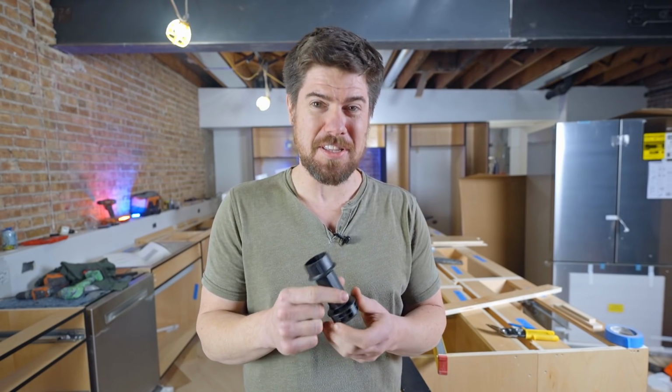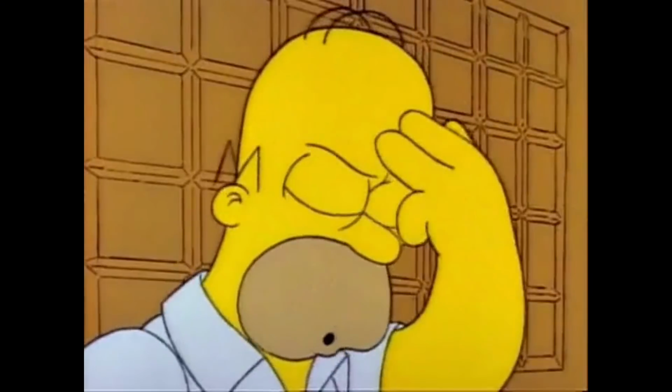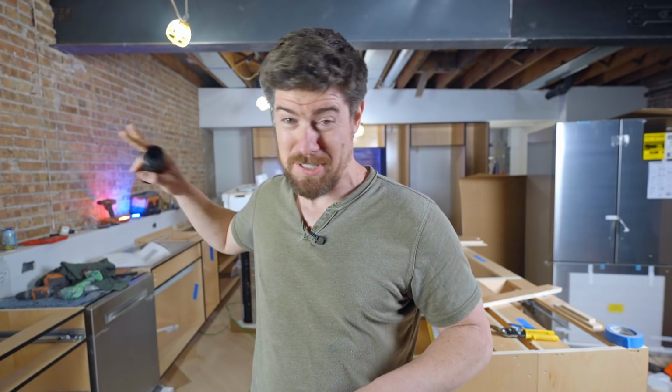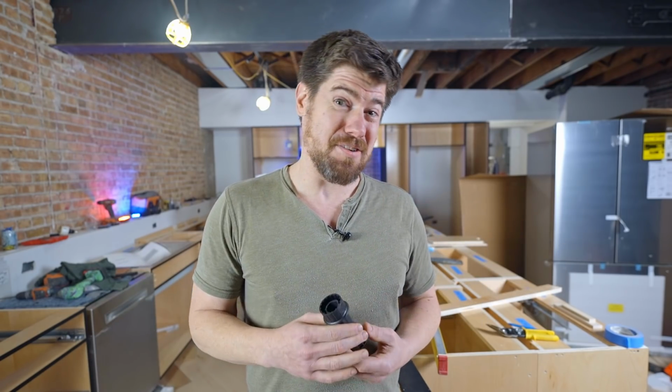And I took a look at the specs and it said, not 3 1/16, 3 11/16 of an inch was the minimum height. That meant all the cabinets I had just made, was already done making, all would be sitting about 3/4 of an inch higher than I expected. That means the countertops are unfortunately going to be a little higher than the standard 36 inches.